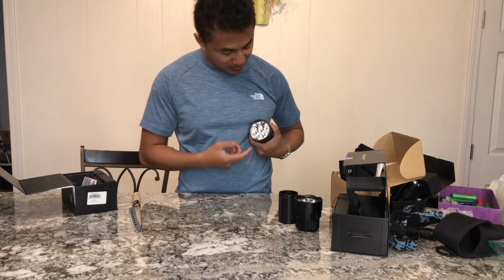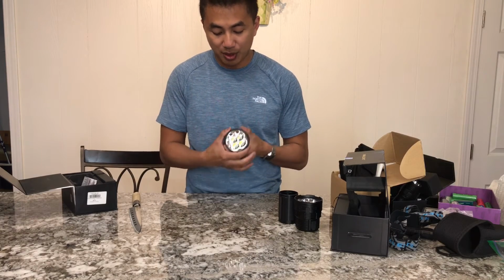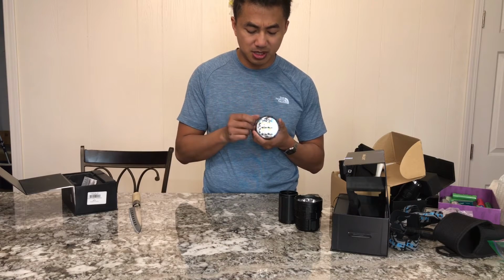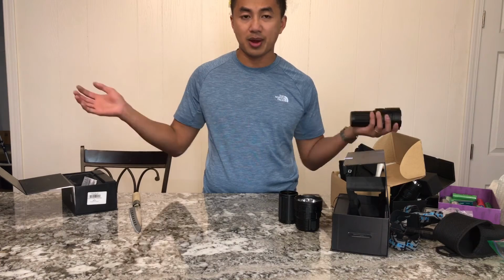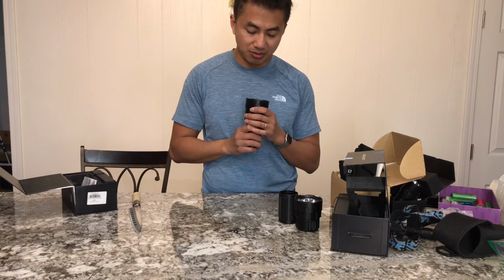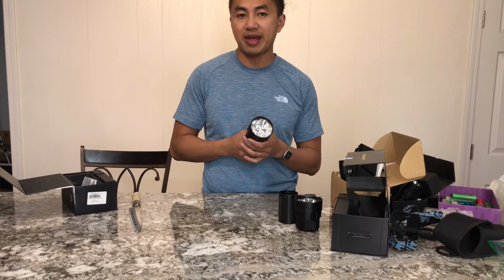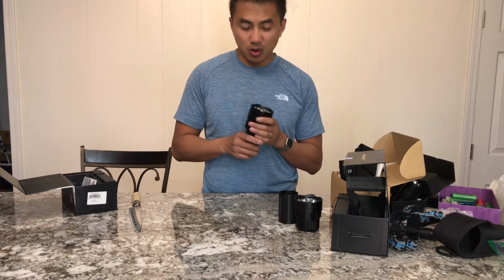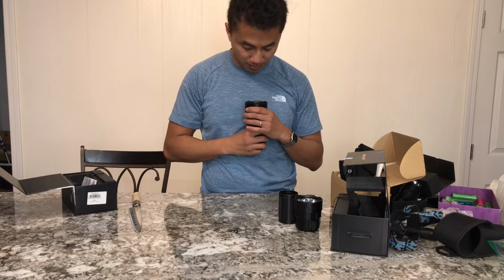But if I were to make this light, and if this is the only diameter head I get to work with, I'll sacrifice some of the depth here to have a wider spill beam and less lumen in the corona. I think it won't reduce the hotspot intensity all that much. But you have a nicer beam, and I think it'll be a nicer light. Less artifacts all crammed together.